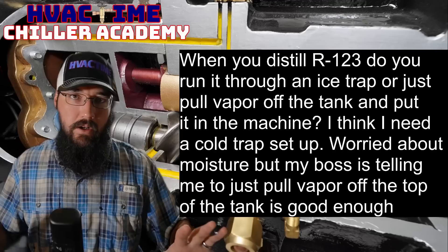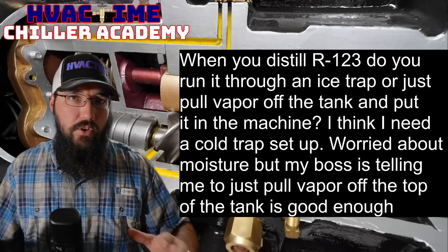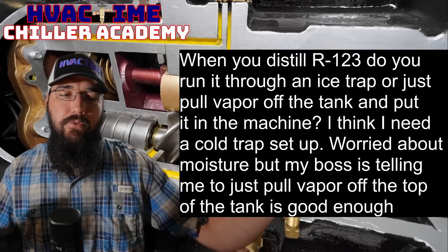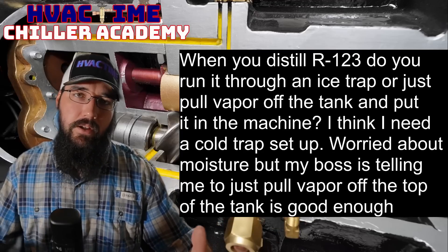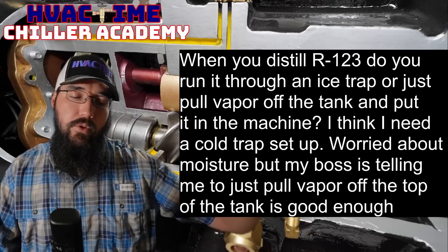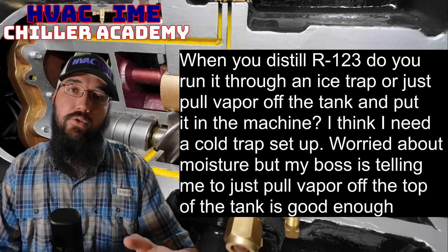You shouldn't go against your boss — I am not overriding your boss or any authority making these decisions. I am just providing additional thought and a further recommendation. The other side of that is cold traps. A cold trap is a dual-canister assembly where we've got a larger cylinder that the vapors get pulled through — typically done during an evacuation. I would refer to it in the service training program as the primary cylinder. Then we have a secondary smaller cylinder that sits down inside the primary. We fill the secondary cylinder with an isopropyl alcohol mixture and dry ice, which causes any moisture that comes in contact with the outside of that second cylinder to freeze to it and stick.